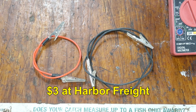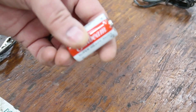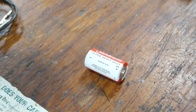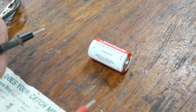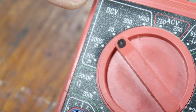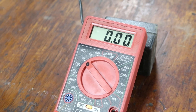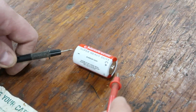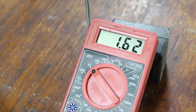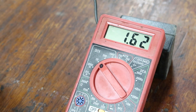For DC voltage, let's start with a battery — a 1.5-volt battery. Look on the side; it says 1.5V. It has a plus and minus. If you hook these up wrong, it won't matter. Pick the range setting greater than what you're testing — I went to 20. Touch negative to negative, positive to positive, and it reads 1.62V. If your batteries are 1.5V and above, they're good. Most of them are about 1.6 when new.